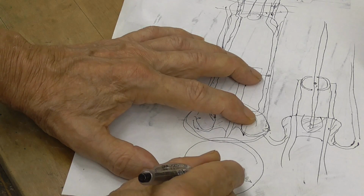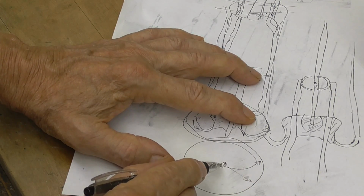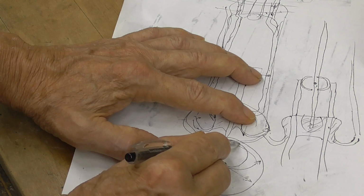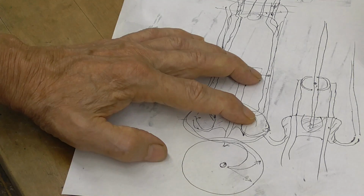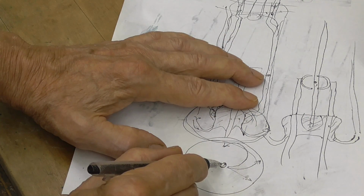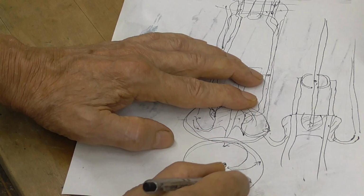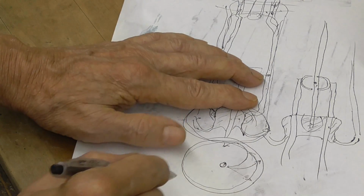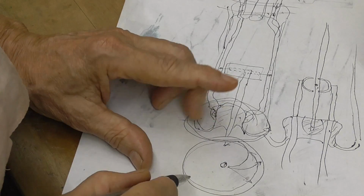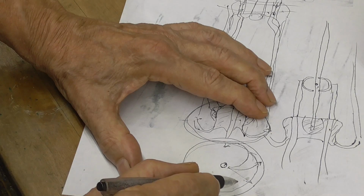the electrons will tend to be diverted. They'll curve, like so. And if we make the field strength strong enough, the electrons will just completely curve in a circle, like so. And at a critical point of voltage and magnetic field, the electrons will go in a circle around the inside of the plate. And when that happens, a negative resistance occurs, and the tube will start to oscillate.